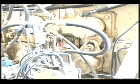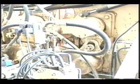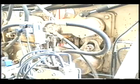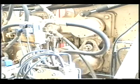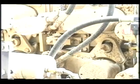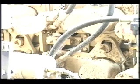In this view from behind the machine, we can see the first set of in-feed rolls open and closed to feed the dowel mill. A hydraulic motor powers each feed roll. The RWS 8040H mill has eight in-feed and eight out-feed rolls. The smaller RWS 6020H mill has six in-feed and six out-feed rolls.